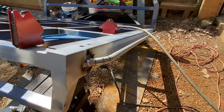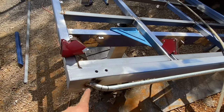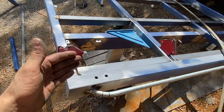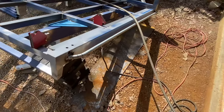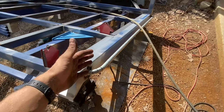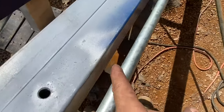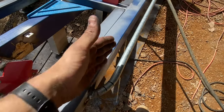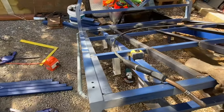I got a new bender for this — just simple, three points. I worked on the furthest point because it was closest to the end. I bent out that one, that one, and that one just so I didn't kink the bar straight up. Then I just sat it against a flat surface, measured 20 mil to that lip from a straight surface, scribed a line through and cut it there. So that's either side — they came up all right.